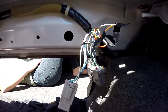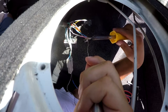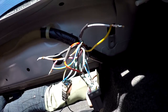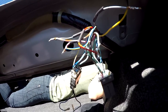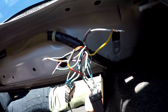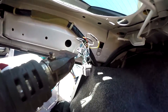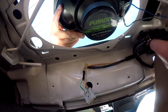Now for the hard part, we're going to have to solder those things and put shrink wrap around them so it's nice and neat. There it is with the solder — we've soldered it. Now we just got to put the shrink wrap around it and we'll be fine. So let's put the shrink wrap over it and shrink it. I've got this speaker all sorted and I'm just inserting it into the hole.